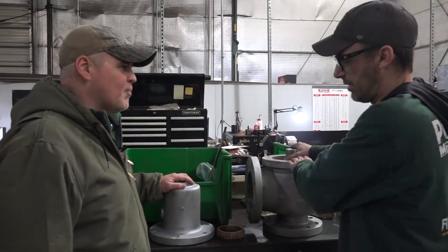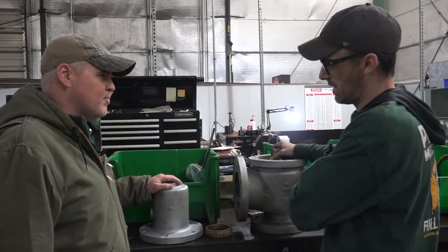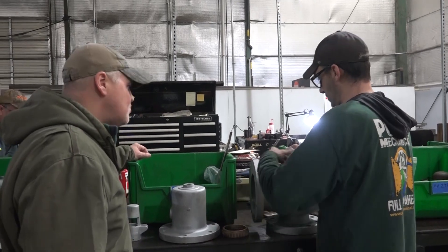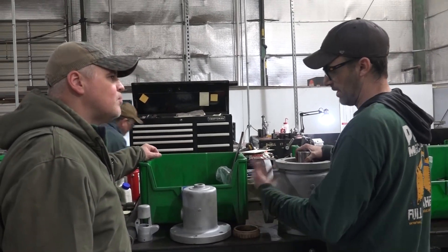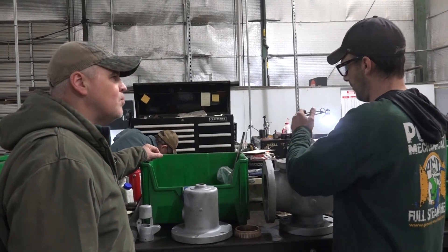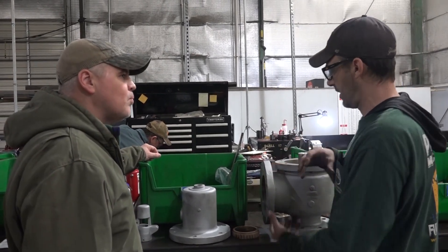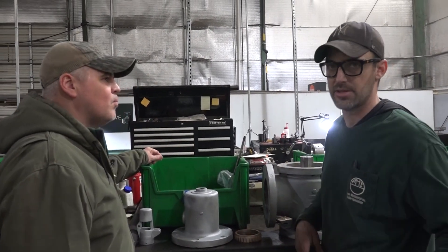Right now I am relapping the seat on the nozzle portion of the relief valve. What we do is tear these parts down to every individual component and we repair, fix, or refurbish — basically bring it back to new. We actually relap the disc and relap the nozzle seats, and that way it ensures a nice tight fit when we go and pop these things on steam.